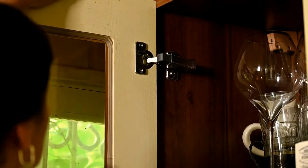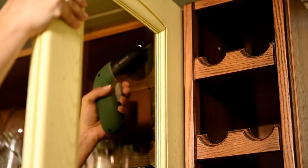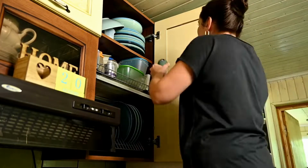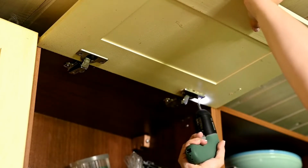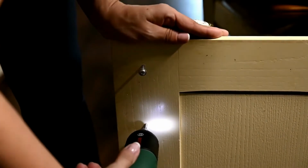The first thing to do, which is essential, is to thoroughly wash all the surfaces you're going to repaint with a fairly harsh detergent or a degreaser. If a kitchen is an old one, you will find some greasy spots after unscrewing the handles, near the hinges or in hard-to-reach corners that must be removed, otherwise the paint will not hold well. In places, I've even scraped off the old varnish coating after the degreaser peeled it off in some places. And of course, you want to let it dry really well.